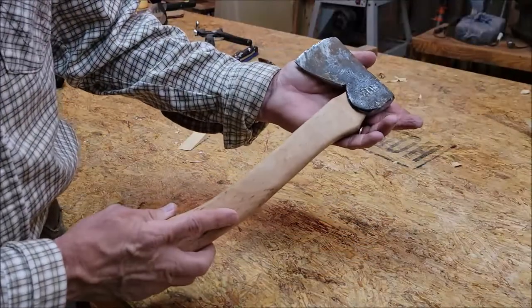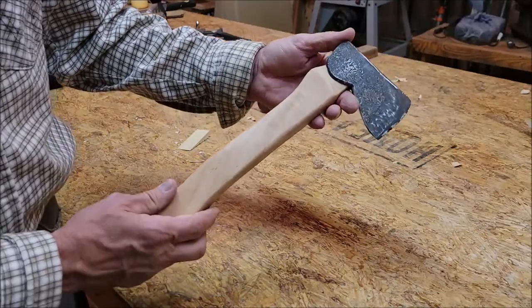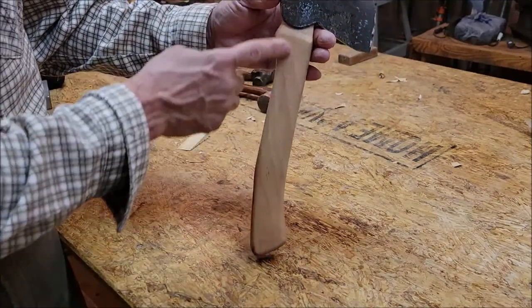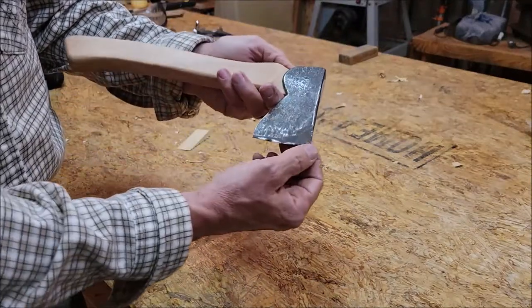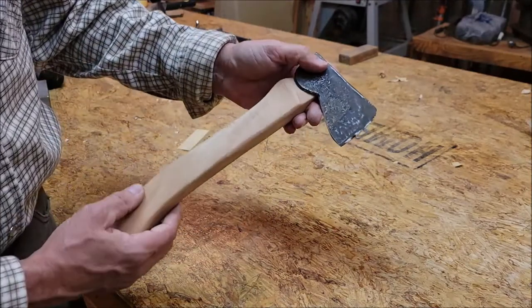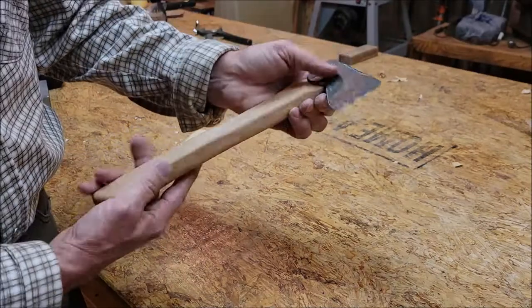If you'd like to see the video where I modified a hammer hatchet into this hatchet, I've got a link in the description, and you can check it out if you like. When it's all said and done, this little hatchet is 12 inches from bottom to top. She's 4.5 inches from the back to the front of the blade, and that blade edge is just under 2.5 inches. The weight of this hatchet head and the handle together is only 1.25 pounds, so this is a little hatchet.